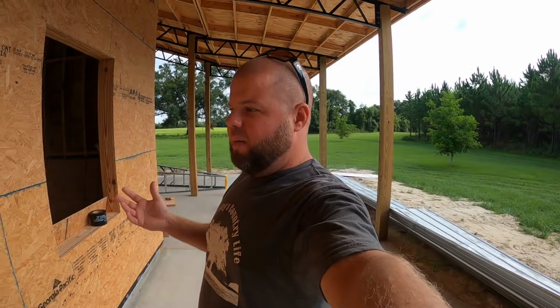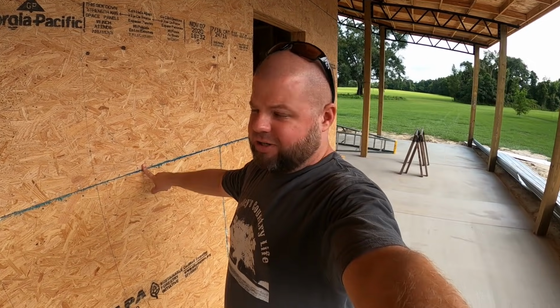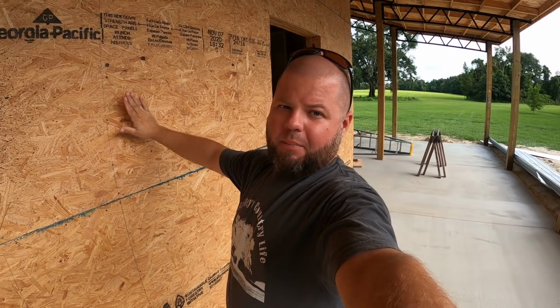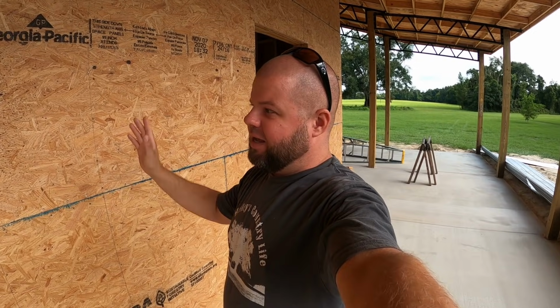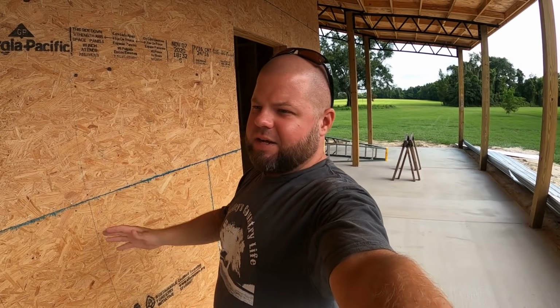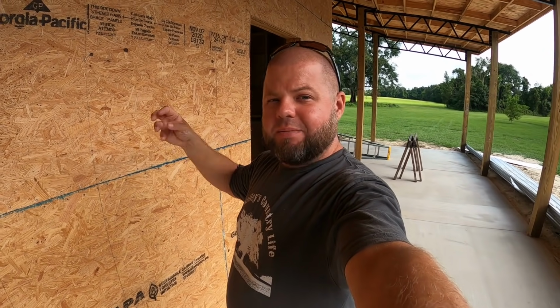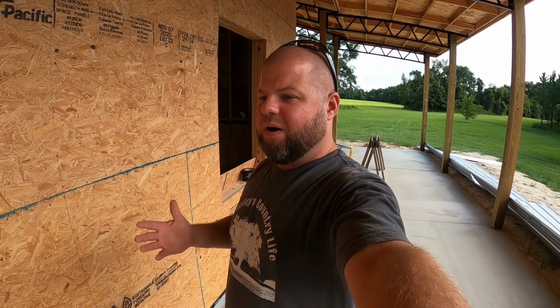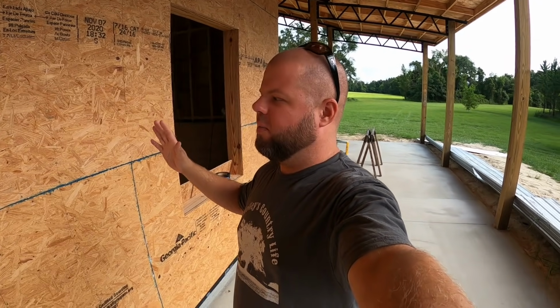Now, also sealing up these seams right now, because it may be a little while before I get house wrap on, all this blowing rain and everything else, we know from testing that the edge is the most sensitive part of OSB, although it performed better than I realized. This outside pressed board right here, it doesn't really seem to absorb water or flake off much, but these edges are what's delicate. So if I can go ahead and get those wrapped and we just get a crazy afternoon thunderstorm that blows rain in here, at least that rain is not coming down, working its way into those gaps and settling on the edges. So that's why I asked for permission to go ahead and tape it up. It'll just make me feel better. It's just one more step toward a weather barrier, even though it's ultimately for an air barrier.